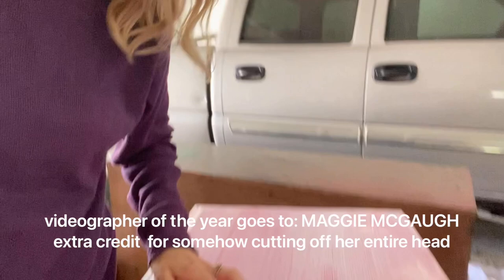You can see there are some little hairs that got in this, some fuzzes. So I'm just gonna take my 220 grit sandpaper and lightly sand the entire piece again. This time, this is just to remove any hairs, fuzz, bumps, anything like that that got in the paint.